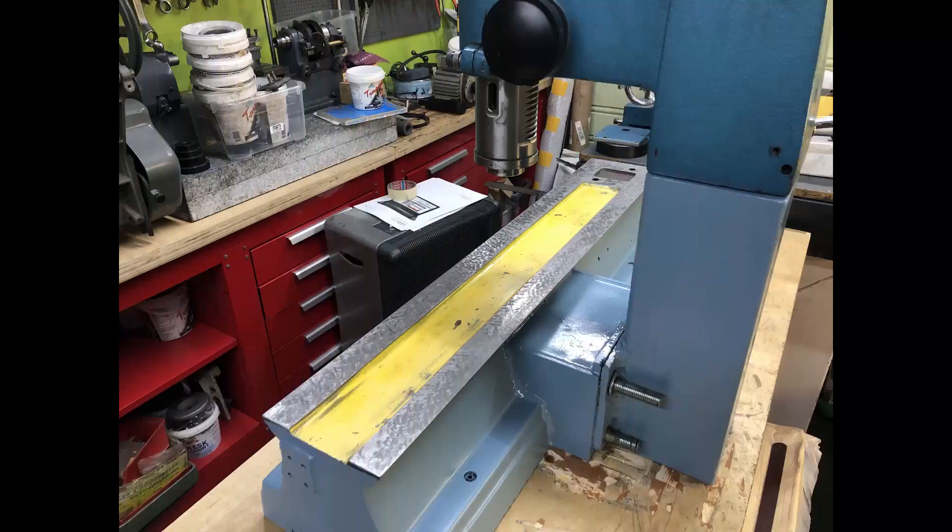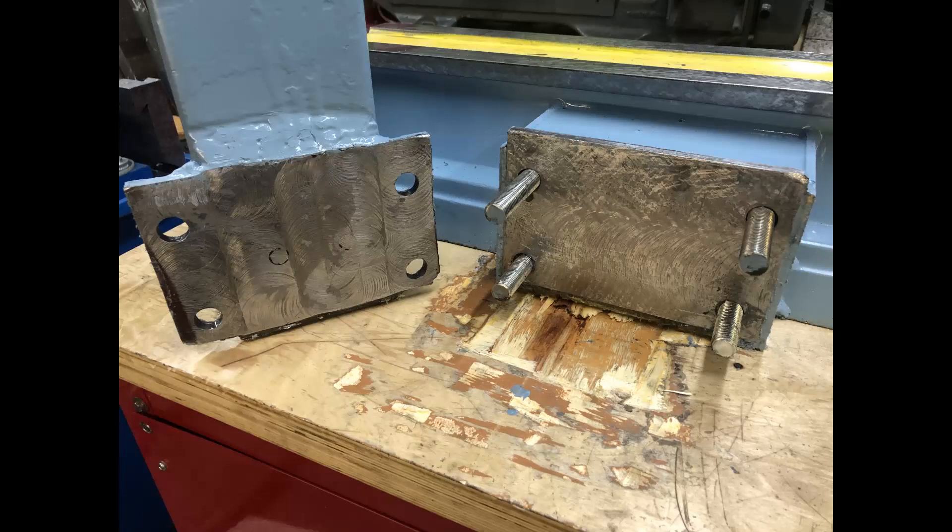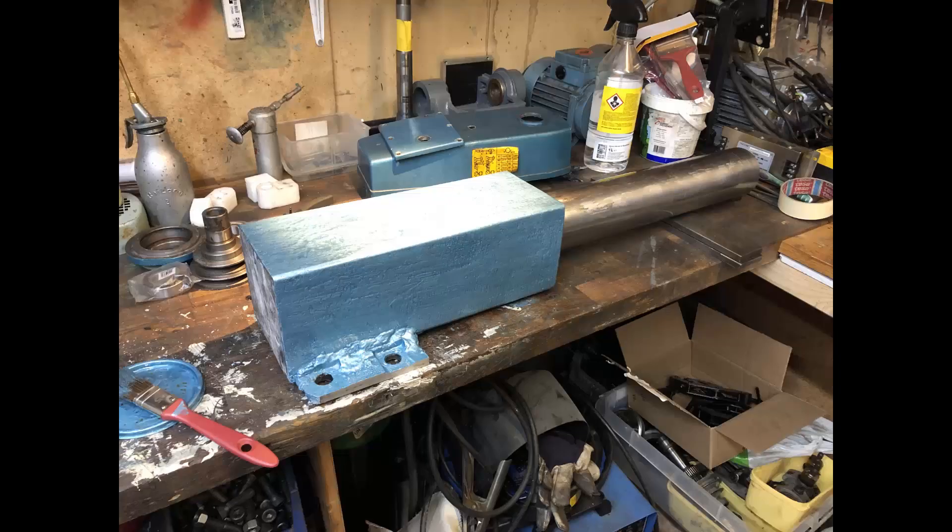Here it is assembled and base painted. I used the spindle for alignment purposes and this will be sufficient for now. Here are the plates unwrapped — they are milled and then scraped, and the holes are a bit sloppy to allow for alignment. The foot and column may need flatness testing at the bottom or adjustment, which is why a modular design is okay.